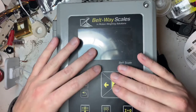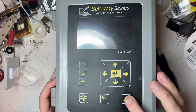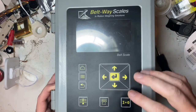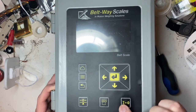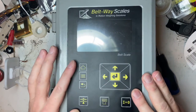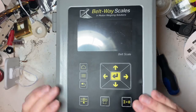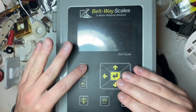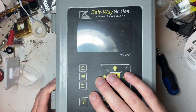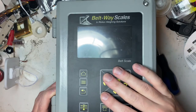Let's start with the outside. This is the face plate. A lot of damage occurs when you don't have a reaction when you clear the screen — people would stab it with a screwdriver, which would damage the keypad underneath and lock up your box. There were three different designs of this face plate that made it to production: two shiny ones — one with no tactile function, one with tactile — and this embossed one. The first two were not UV-rated, so you'll see those face plates cracked and literally destroyed.